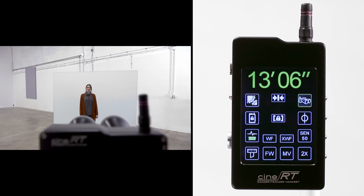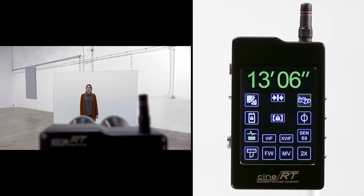If a subject surface is reflective and at an angle to the base sensor, the pulse can be deflected away from the base, making it too weak to be detected by the receiver.